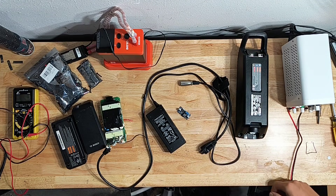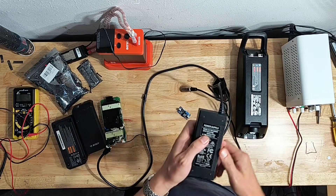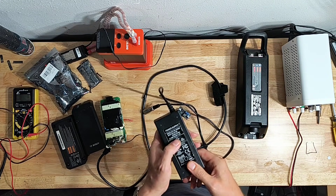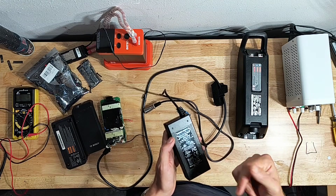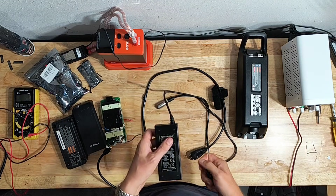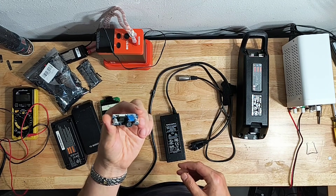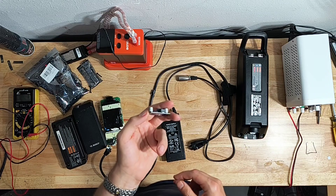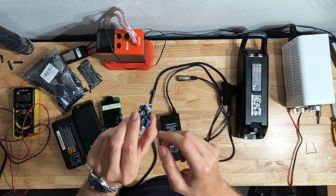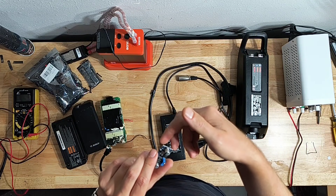This is for entertainment purposes only — don't do what I do. I'm using a 42-volt 2-amp lithium charger for 10s batteries. 42 volts divided by 10 is 4.2 volts per cell, which matches the Bosch pack — it's a 10s pack. The buck converter I'm using is a step-down converter — I'll put a link in the description. I bought a 10-pack for about nine bucks. It takes up to 50 volts in and outputs up to 35 volts, so 42 volts input should work well.